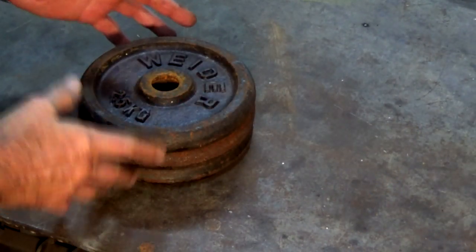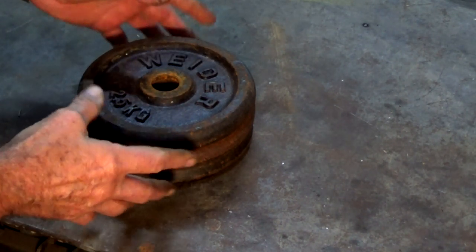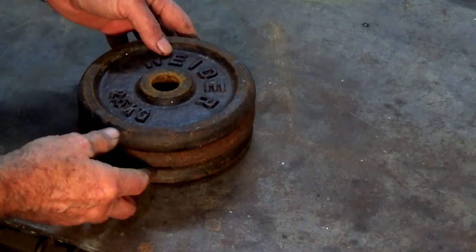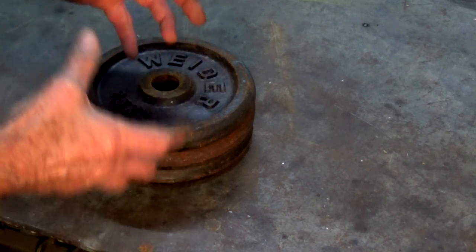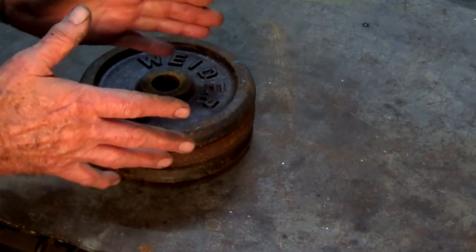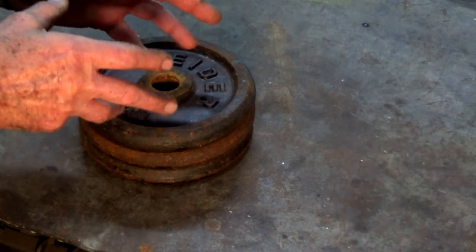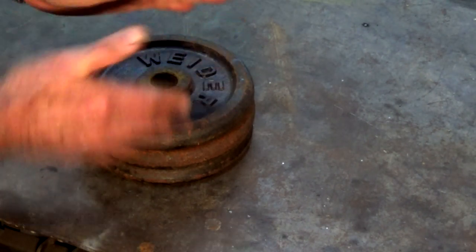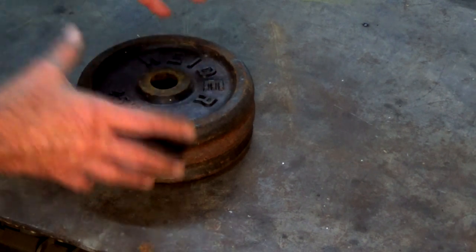One of the important features of a sand muller is some sort of compactor wheel, and the purpose of that is twofold. It helps to break up the lumps of dried green sand that have been in contact with the hot metal in the mold, and they can be quite difficult to break up by hand. The other purpose is to force the clay particles in the green sand into intimate contact with the sand particles, or the sand grains. And it's that crushing and rolling process that helps that green sand to become good for